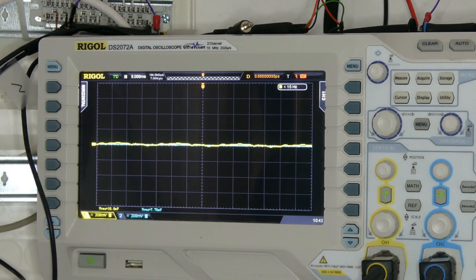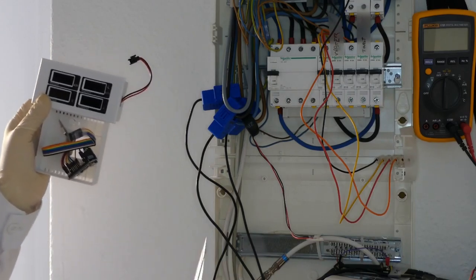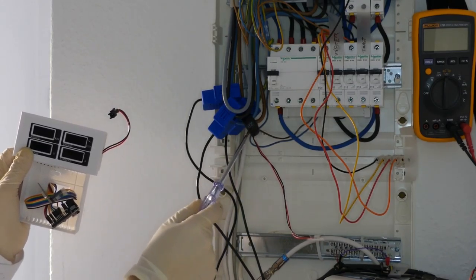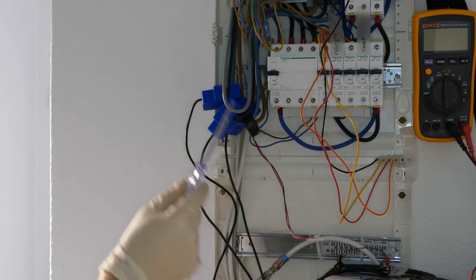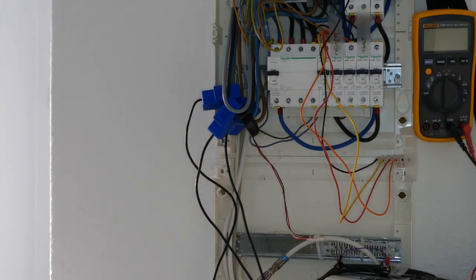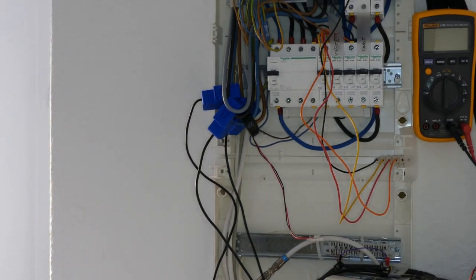So what I had measured was not actually the total current consumption — only when something was unbalanced, meaning that not everything goes through the three phases but something goes back to the neutral. So all the measurements I have are only the unbalanced values of my current consumption, not the total value of all the currents on the three phases. Now if you want to measure the total consumption, what you have to do is simply measure the current going through all three phases and not through the neutral wire. The neutral wire just shows you when something is unbalanced. When it is completely balanced and the same current is used on the three phases, the neutral wire should be at zero. That's also the reason why the neutral wire doesn't have to be thicker than the three other wires. Using the spark meter, I cannot measure the electricity on a three-phase system. It works on a single phase where everything goes back to neutral, but on a three-phase system I need to measure the current consumption on each of the three phases and then add it. So this one is only good for one phase, and for a three-phase system I need to do something else. But that's for the future, that's upcoming — and until then, enjoy!